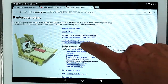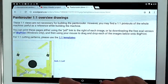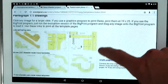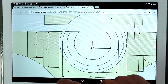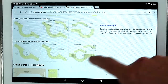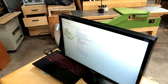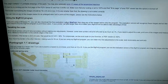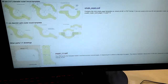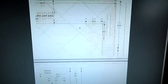There are also one-to-one drawings — large printable drawings that print across many pages. Also smaller parts, for instance the shape for the router mount, which is kind of complicated. I did build it without the templates this time, just by using the geometry on the drawings to recreate that on the plywood. You can also download the zip files onto your PC and browse them there, or print various parts. There are PDFs in there — for instance, for these parts this one stretches across multiple pages, and there's an alignment grid for aligning the pages once you print those out.